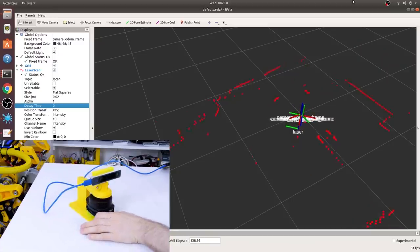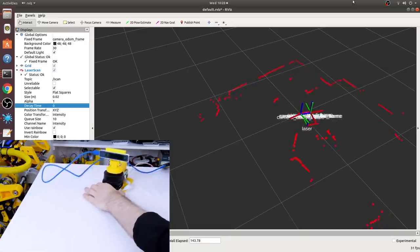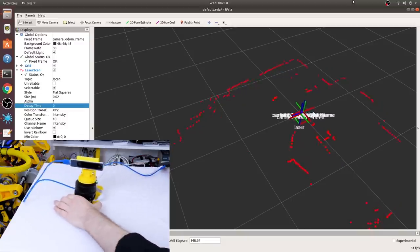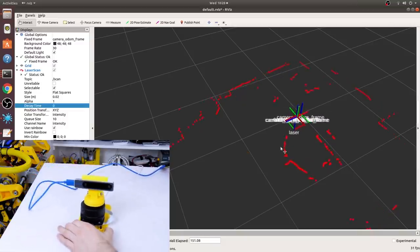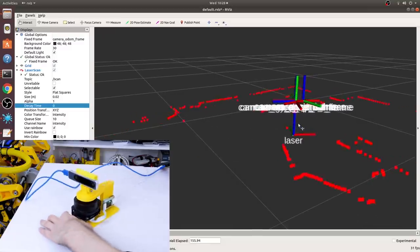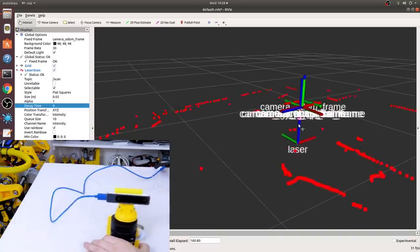We're using ROS, the robot operating system, and here I've applied a transform to stick the laser and the tracking camera together. That means as we move the tracking camera around in the environment, we see a transform for the laser moving with it, and the laser scan should stay still, plotting out the walls as the camera and the laser assembly moves within it.